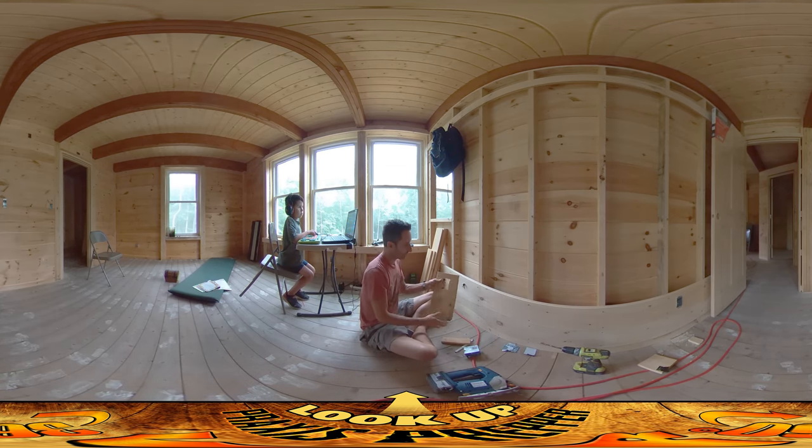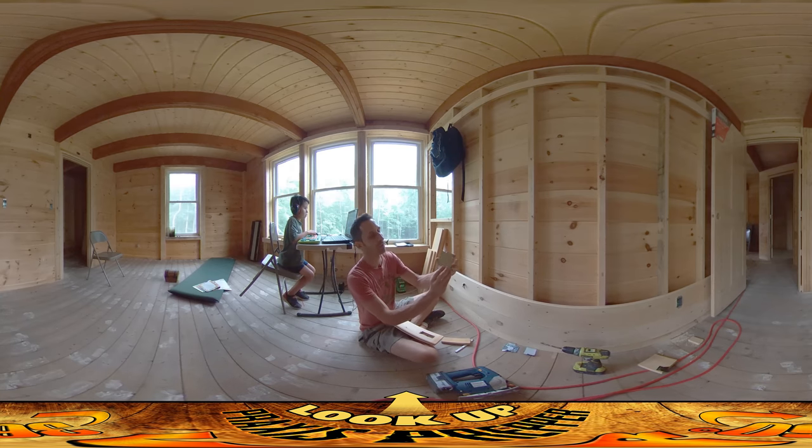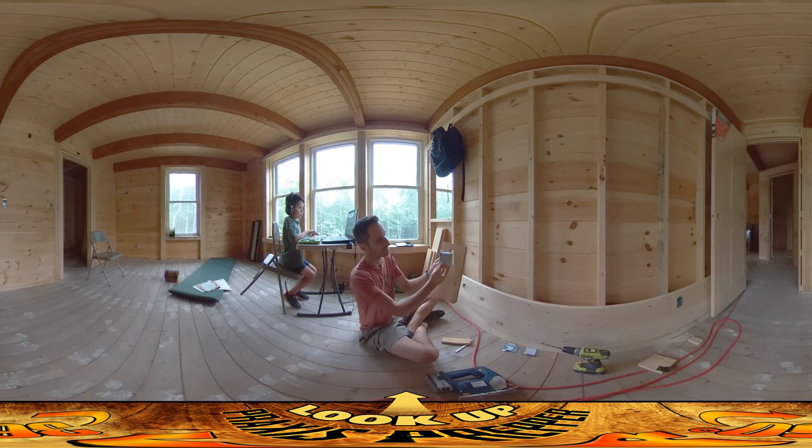In order to put in these electrical boxes, we've made up this little template. It says 'this side out' — you want to put it up to the wall that way as opposed to the other way. The reason is that these metal boxes have screws at the corners and you need those screws to be able to pass through these little holes on the sides.